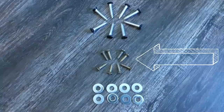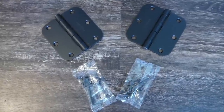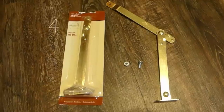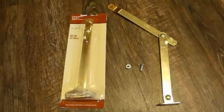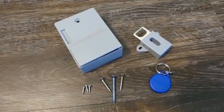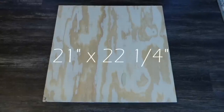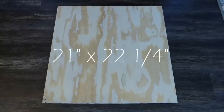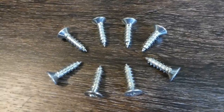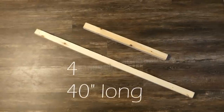Two 8-inch T-hinges — half of the accompanying screws will be used, but you'll also need eight 0.75-inch screws; I added washers as well. Two 3.5-inch hinges, two small 1-inch hinges, one handle with accompanying screws, four cabinet lid support hinges, two small machine screws that will fit through the hole of the hinge, and two small nuts. An RFID lock and fob set, and a piece of plywood cut at 21 inches by 22.25 inches. Depending on the thickness of your plywood, you'll also need eight screws that will drive in but not go through the other side.